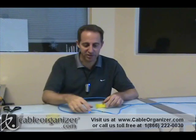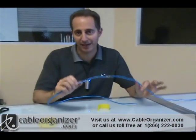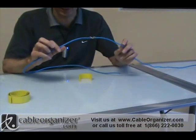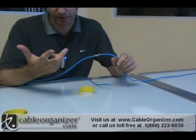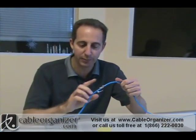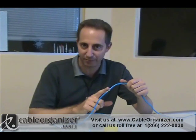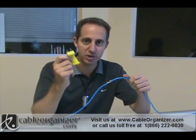Here's an example of a situation where we have a splice that we want to cover up. Let's say you've got two cables that you cannot separate. If you could separate it, normally all you'd have to do is buy some regular heat shrink, slide it down, reconnect it, and then use your heat shrink. But in this case, let's pretend we've got a cable that cannot be separated, but we want to protect this splice, make sure that people aren't messing with it, or maybe protect it from the environment. That's where you would use a wraparound product like heat shrink tape.